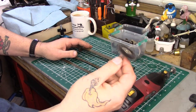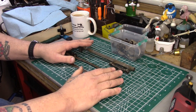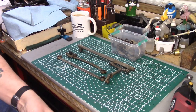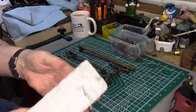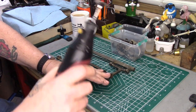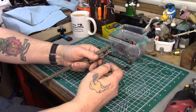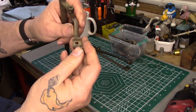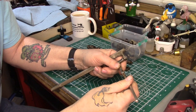I'm going to use this rotary tool with readily available wire brushes and other cleaning tools to clean and polish the internal parts of this machine. I do use one thing that's a little different but easy to get: a rather large brick of polishing compound. You can see it's been eaten up by the buffing wheels — I keep it in a drawer on the lower right side of my bench. We're going to start with the feed dog rock shaft and the bearing on the end of the arm where the feed dog attaches. That bearing is supposed to spin freely, but this one is locked up solid and has a ton of crud on it.